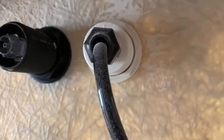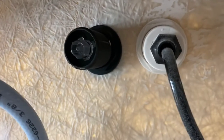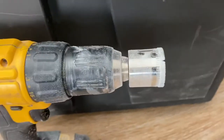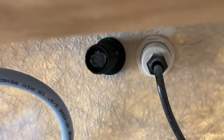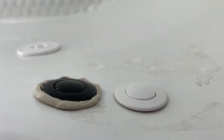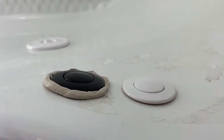These are air push buttons — I thought they were electrical like arcade buttons, but they're non-electrical. I made another hole using a diamond-cut one-and-a-quarter-inch circular drill bit, and I'm basically adding a push button for the heater. These are only about $20. You can see my plumber's putty there — you don't really need it since there's a rubber guard, but I did it anyway just to secure it.